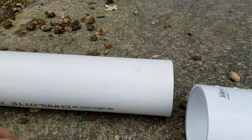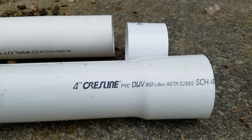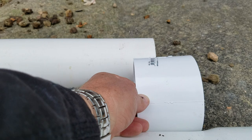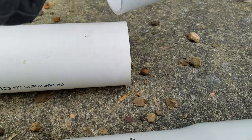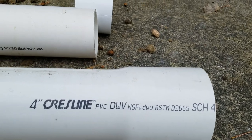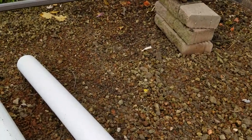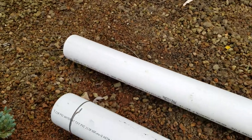We're using 4-inch Schedule 40. I really like Crestline's product. I bought this piece at Home Depot just to show you what not to do. It goes together with these couplers — these couplers are three and a half inches, and you're splitting them because you have to share it. This belled end is four and a half inches, and you're not sharing it — you're sliding a pipe in. There's a belled end right there off a piece of pipe that we cut, so you can see that this piece from Home Depot has to have those three-and-a-half-inch couplers — it doesn't have that bell.